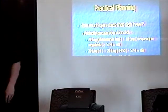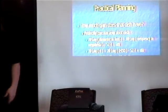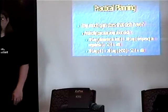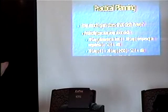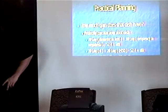How much gain does a dish have? Suppose you were driving down the road and saw a dish and thought you'd take it home. You can actually use these figures to calculate more or less how much gain it would have, assuming reasonable illumination. A four-foot dish works out to about 27 dBi — only about 4.4 dBi higher than the conifer, but the conifer is parabolic and not perfectly circular. Circular dishes are very easy to find because most land-based microwave stuff uses them already. The higher the frequency, the better condition the dish has to be in and more perfectly round. Most of the ones used for terrestrial microwave links operate at such high frequencies that at 2.4 GHz they're just great.